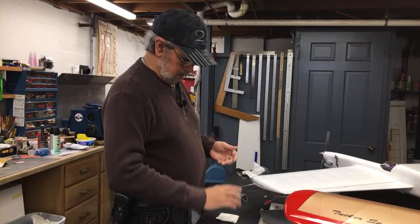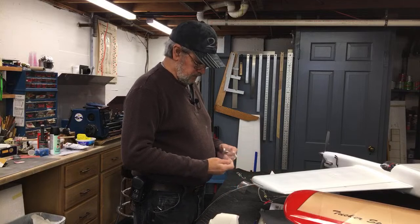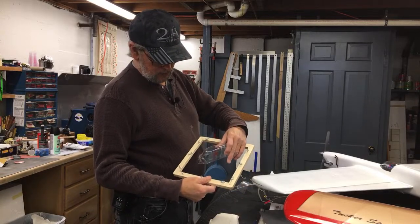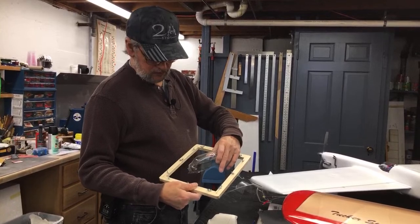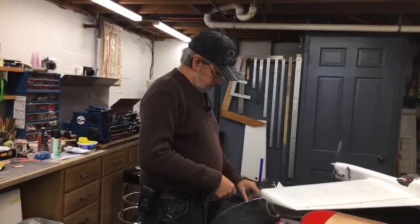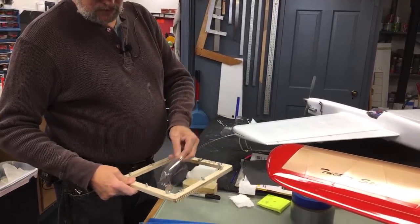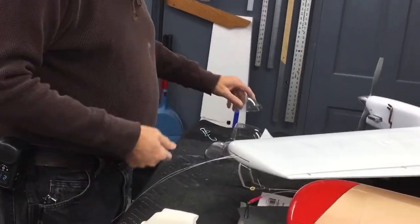And so I pulled some canopies on it, and I haven't done this in about 15 years, so I ended up with some mistakes. The first one, I had a big crease in the front of it where I laid it angled corner to corner like this. And I guess it left too much slack in the plastic when it drew down over it to pull it all out. Not to mention that I had the plastic too hot. And then the second time I pulled one, I turned it around sideways like this and I held it to the back a little bit. Well, that left too much plastic in the front and it put another crease in it on this side. So there's two pieces of plastic that's down.